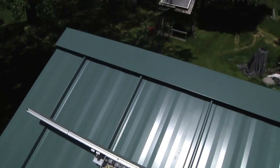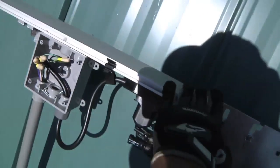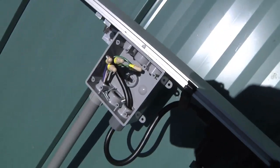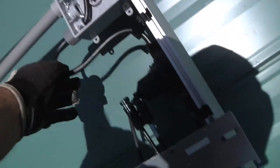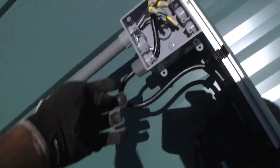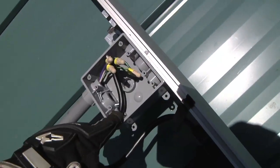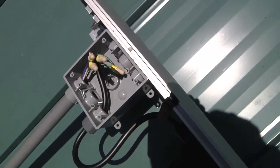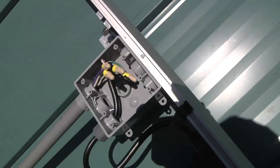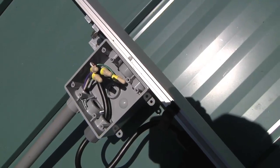We are up on the peak of my roof, the left side, the west side. Here is the last microinverter in a string, and then I'm using a junction box. This is just a two-gang outdoor-rated box, and I've got the trunk cable from the microinverter going in through a strain-relief weatherproof cable gland into the box. This is all 12-gauge wiring, and it's just wire-nutted together. I'll just put the cover on there, and that has a waterproof gasket, of course.